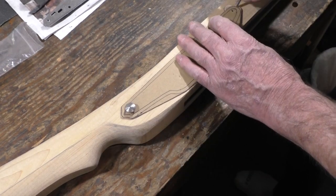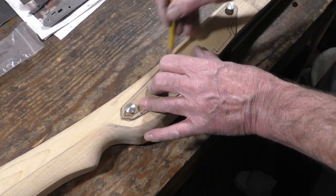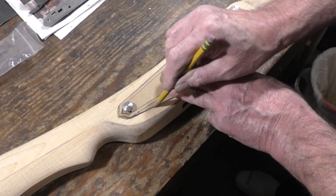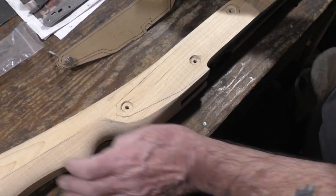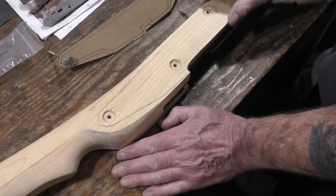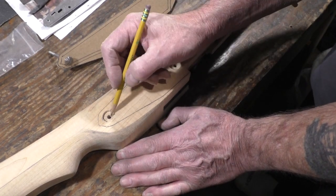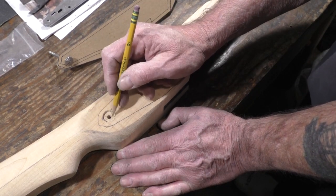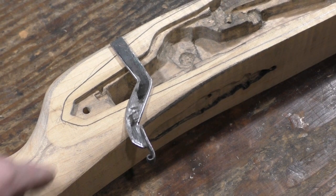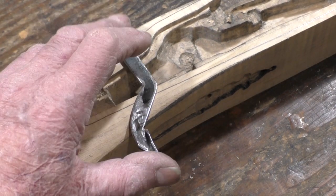I'm not sure what I'm going to do with these holes yet — I'll see how much this takes out. That counterbore tool I got: I didn't turn it by hand, and it's a kind of ragged hole and a little bit oversized. I think I'm maybe using some brass tubing rings or copper tubing rings to go in here. But right now I have stock shaping to do. I've also got my final trigger shape — I'll start cutting the slot for it. I'm going to pin it as high as I possibly can to give it the most leverage for the least travel to trip that sear.